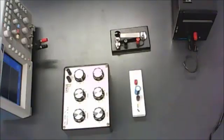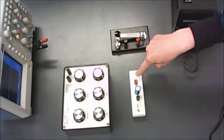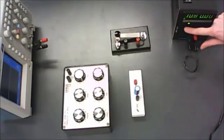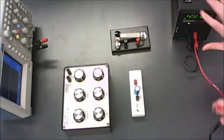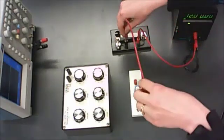Part C is where we start doing real physics — we're going to build an RC circuit where R stands for resistance and C stands for capacitance. You'll be using a 1000 microfarad capacitor. The first step is to connect the power supply via a switch to the capacitor, with your voltage set to 12 volts. Go from the positive end of the power supply to the switch, and then to the positive end of the capacitor.